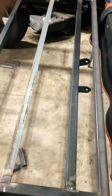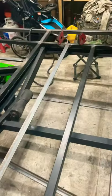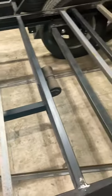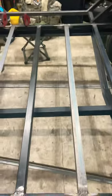I ran two inch-and-a-half by inch-and-a-half cross members — the same ones; those are the black ones there, they just had a coat of paint since it was outside. For the intermittent portions I just used some angle iron, inch-and-a-half by inch-and-a-half 11-gauge, and they're plenty strong enough to help hold up the plywood and decrease the span the plywood has to absorb.